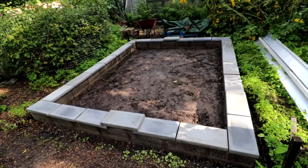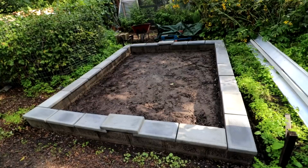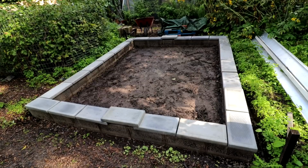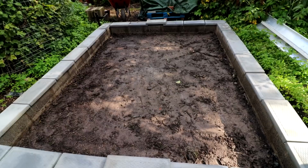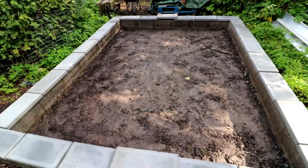So it's about 10 o'clock in the morning now, and my wife asked me, are you going to put plastic down on the bottom? And we were thinking, if I put plastic down, it's going to catch water. Now, the landscape fabric might be okay because it might let the water through, but I'm thinking, because this is just clay down here and I've got a good layer of gravel, that I don't think I'll get weeds growing up in the greenhouse anyway. So I'm just going to put the gravel down straight on top of the clay here. And I'm just going to build it.